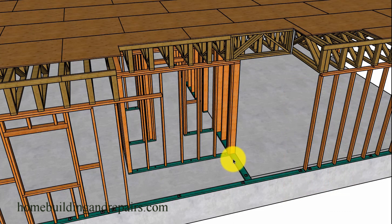Make sure that the plates run through on your bottom plates if you can. You're going to be building the wall later, but that doesn't mean the framing plate can't run through. It's nice to have this stuff running through continuously.